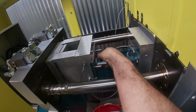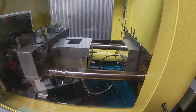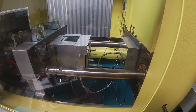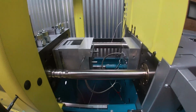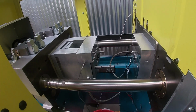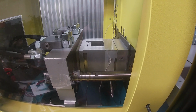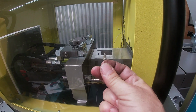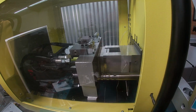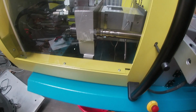But I think I'm going to be stuck pulling this ejector pin out, the center sprue, until I can reduce the grab on that center sprue ejector. So we're going to be stuck in kind of quasi-manual mode for a while because I got to get first articles delivered. So when I pull the mold back off, I'll reduce the aggressiveness of this undercut grab feature on the sprue. But yeah, here's two more parts, looking good.